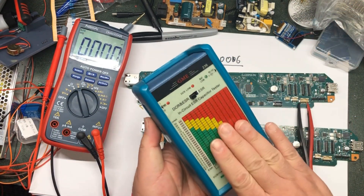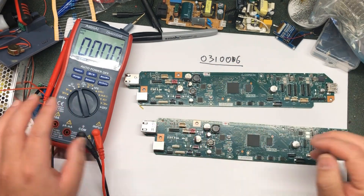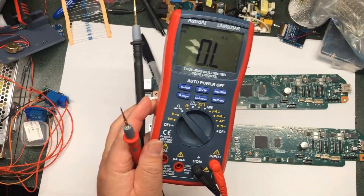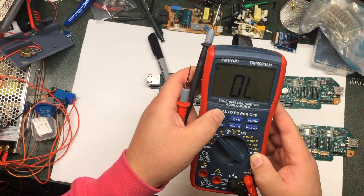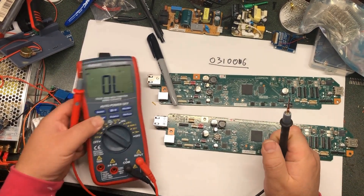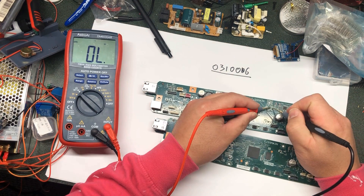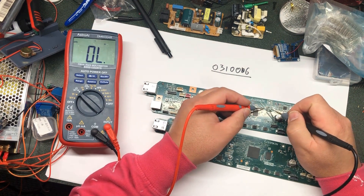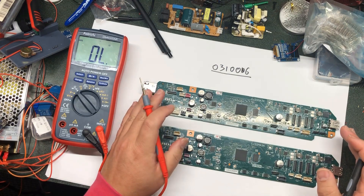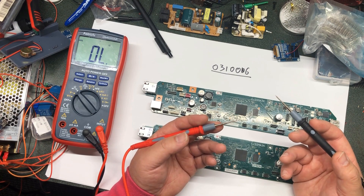So that's why this ESR tester comes in. It has an in-circuit mode and a beeping mode. If the circuit is closed you're going to hear a beep, and that's also how you test the F1 and F2 fuse. Let me test the F1 fuse — F1 fuse is good and F2 fuse is good. For capacitors you should not hear a beep. This is called a DCR test — testing the DC connectivity.